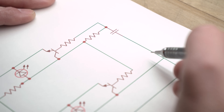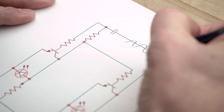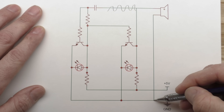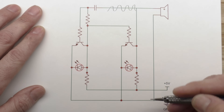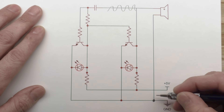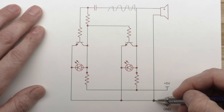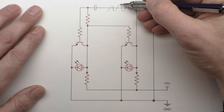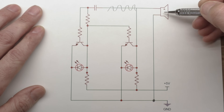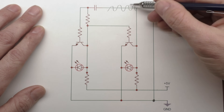The speaker is just piggybacking off of what's happening — through this line you're getting an oscillation of positive, negative, positive, negative. When I connected it on the board, I connected it wrong: what was supposed to be on ground went to the positive. I'm also missing a node on the schematic that should show the connection point. But when I connected it to positive it still made a sound because all it's doing is giving a positive/negative pulsation that makes the speaker vibrate and creates the sound. Whether you connect it to ground or positive, you still get an oscillation.